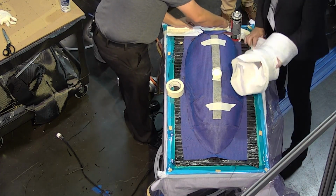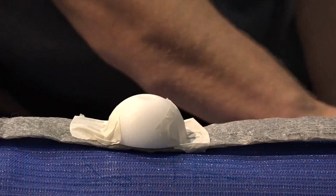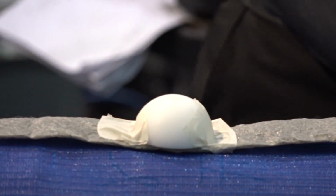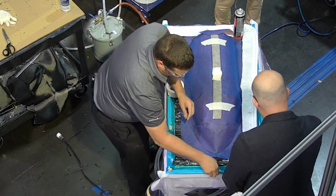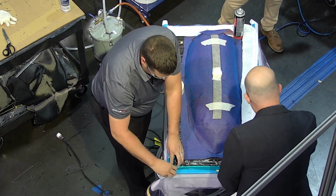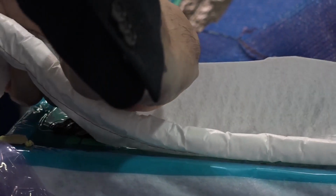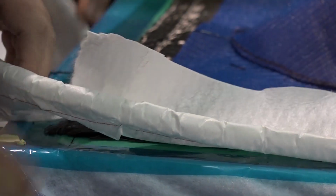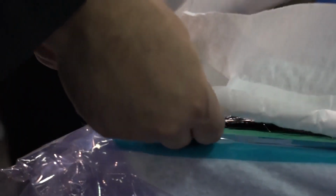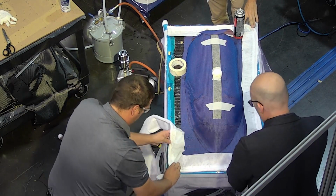So we have the vacuum ports, or resin infusion connectors, that we're putting over the top of that infusion line that we're going to actually penetrate the bag and install the tube into. And Travis is putting around the vacuum manifold, which is in fact a Vectorply product that allows us to have really very effective vacuum flow around the perimeter of the mold.